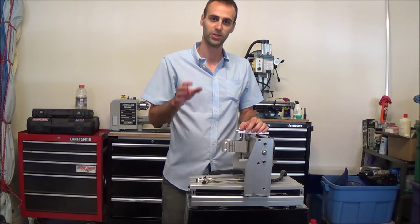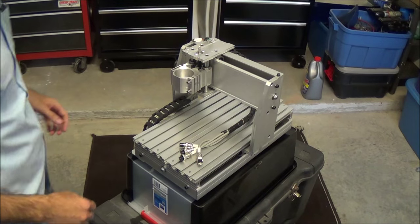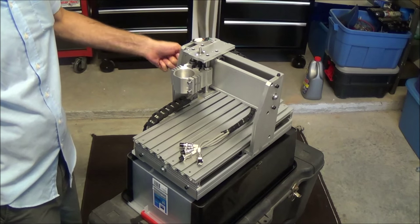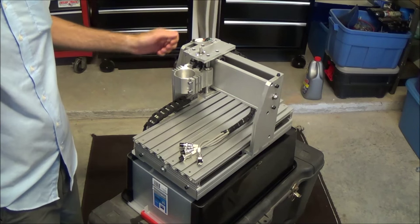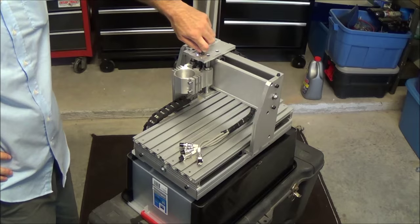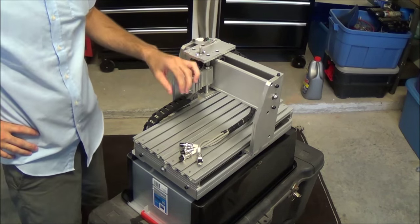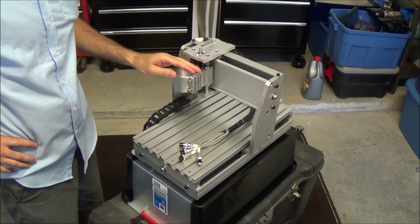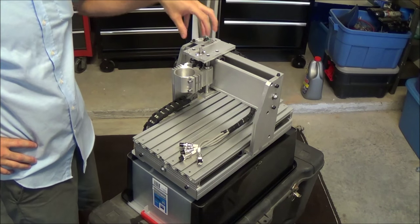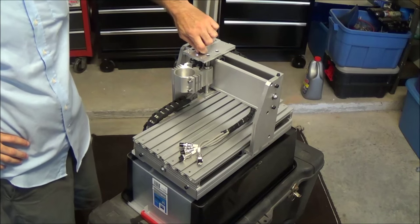So let me show you this machine and talk about what we're going to do. You could buy these machines on eBay for, I don't know, $500 or something like that for this three axis. This is what they call the CNC 3020, and I don't know who makes it. It's some company in China, but it comes with a little 1/8 inch ER11 collet and spindle, which I've removed. It comes with all of the mounts for the NEMA 17 motors. It comes with the couplers